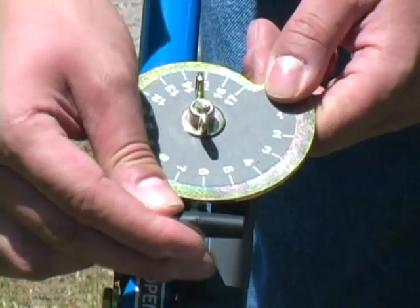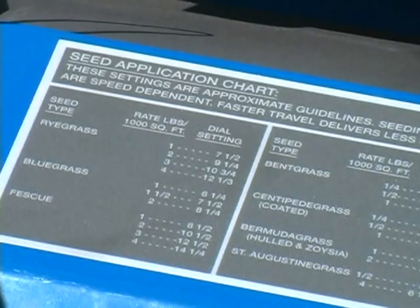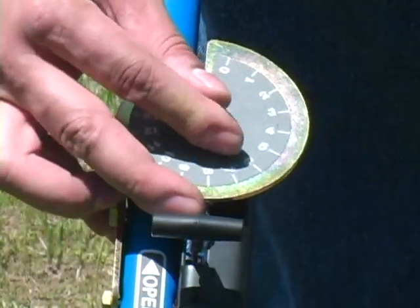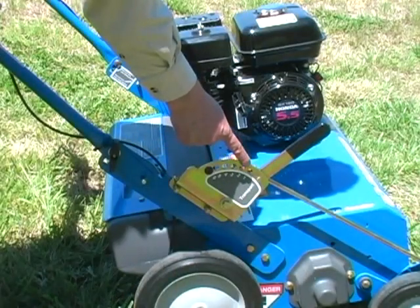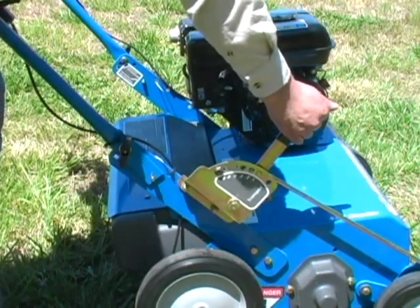The open and close handle opens or closes the seed hopper gate located on the underside of the machine. The seed hopper cover features an application chart, showing the seeder dial settings based on the type of grass seed being used. A depth lever on the side of the machine raises and lowers the delta reels. Simply push in and move the lever to the correct height. Higher numbers increase the depth of the reels.